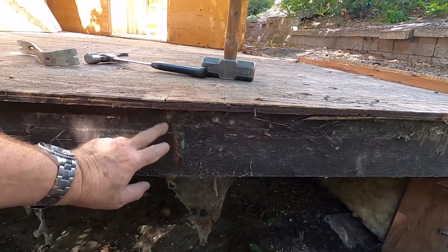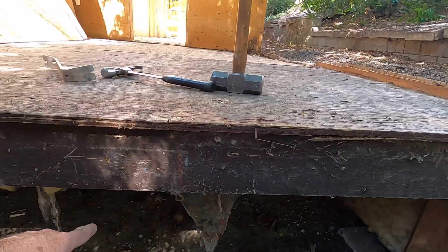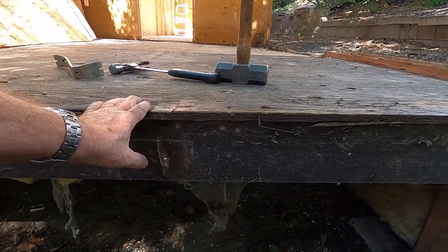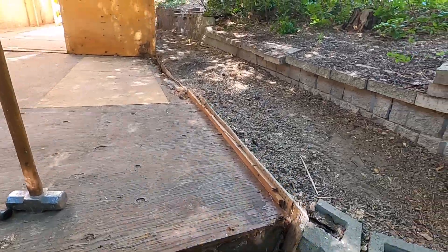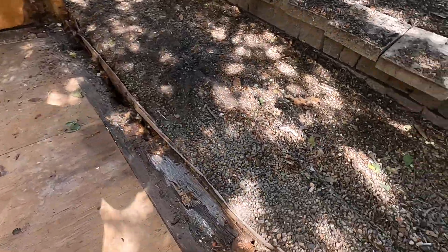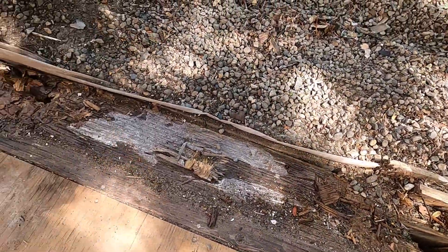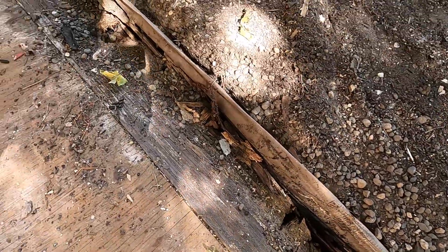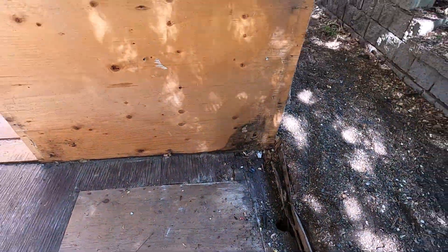This has held up pretty good actually. The floor here has two-by-six joists, which is not heavy enough — all of this should be two-by-eight. This was originally an exterior porch and it should have been treated lumber, but it's not — just regular lumber. As a result we have all this rot along here where that outside wall was sitting. You can see how it's all rotted — so for those of you who thought we could save this, absolutely not.